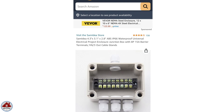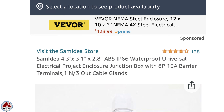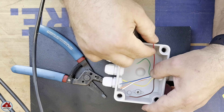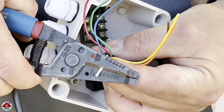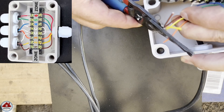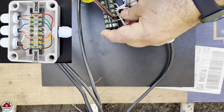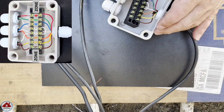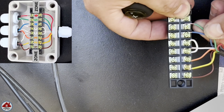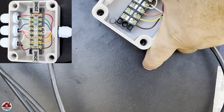So this is the waterproof universal electrical junction box I tried — its waterproof rating is IP66, but I think I needed IP67; more on this toward the end of the video. My first step is on the wire I just ran through the attic coming from the controller: I take the individual wires, size them up, cut them to size, and strip each one. I install them on the terminal strip which has 8 connections — starting with the middle two screws for the white common wires, I use a small jumper connecting them. Next I wire up zones 1, 2, and 3 keeping it in order, referring to my notes to remember the color I chose for each zone. Then I wire up zones 4, 5, and 6. The colors just help you keep a consistent configuration. Then I reinstall the terminal strip to see how everything looks — it was much easier wiring this side with the terminal strip not installed; we won't have that convenience for the other side.